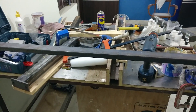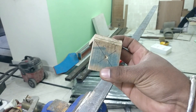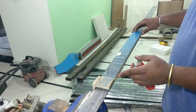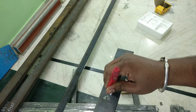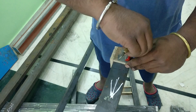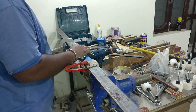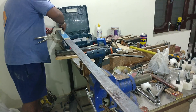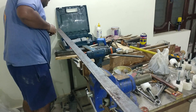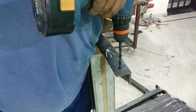I start the preparation for drilling holes into the angle iron pieces. I mount the piece in my vise and with the help of a jig and spacer block I drill the holes equally apart using an M9 drill. In the video you can clearly see how I approach the marking location and then drill them. I drill these holes 1mm larger than the fastener I am using so they provide a slight amount of movement for fine adjustment. I repeat this process for both sides of the angle iron — one side attaches to the leg assembly and the other attaches to the main bed.